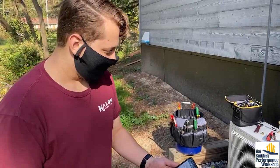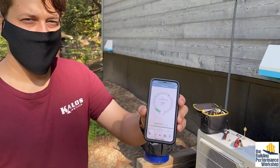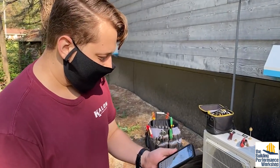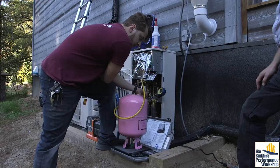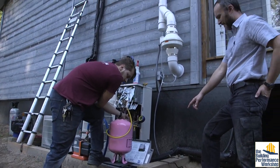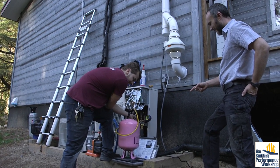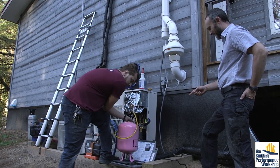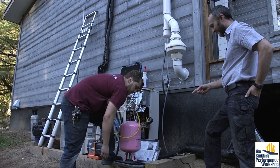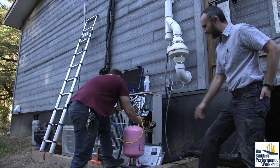What we got here, Caleb? We have a really tight system — under 50 microns in less than 10 minutes. Is that your personal record? It's my personal record, yeah. We're adding seven full ounces of extra refrigerant into the system. But because you're smart, you're not going to do the full seven — nine point one, nine point zero — because the hose also contains refrigerant.